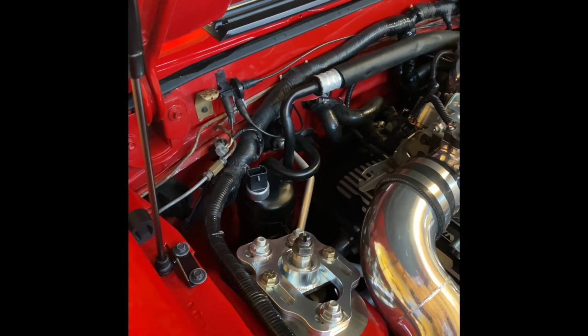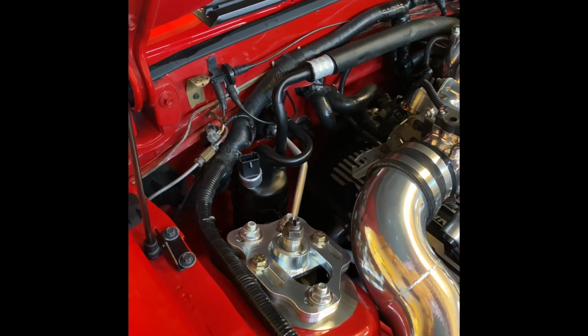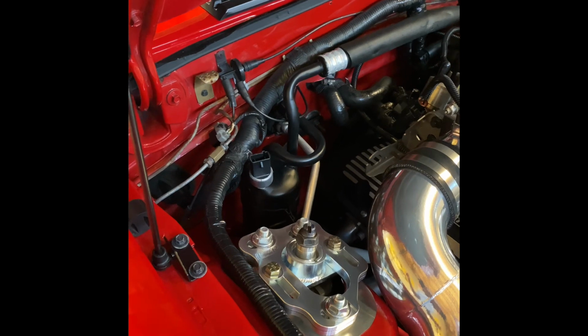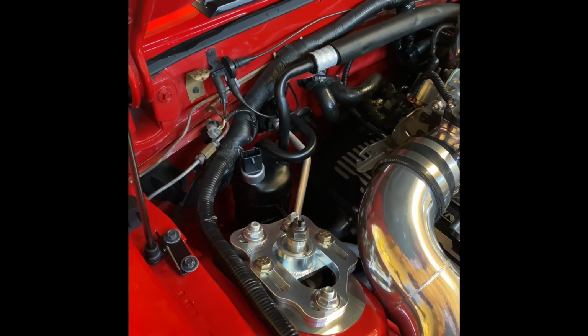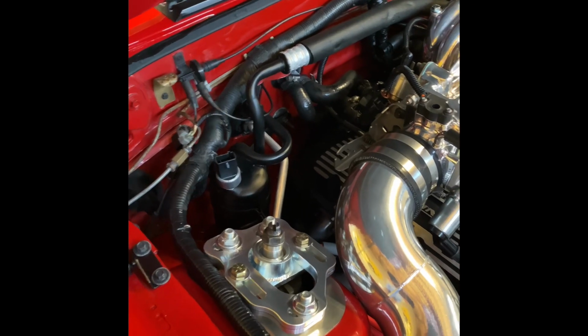So make your adjustments. Look at what your specs are for where you need to be. Make sure your AC is fully charged and run it like it's supposed to, and then adjust that little screw in there, and you'll get your compressor to kick on and stay running, and then get it to the pressure where you need to be, and you'll be good to go.